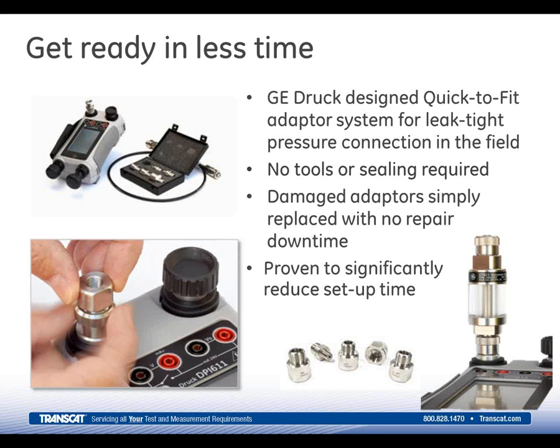And very often, if customers aren't using 2 wrenches to tighten those fittings down, they may over-torque the connector that goes right into the base of the unit and actually crack the case on the unit itself. So the fitting that's actually on the bottom of the unit itself will swivel, so you have to hold that with your hand, but the connection on top, you'll use wrenches to make that connection, but you can easily just thread that down, and it's a hand-sealed fitting, and it protects the device itself from any kind of costly repairs and issues that may come up.